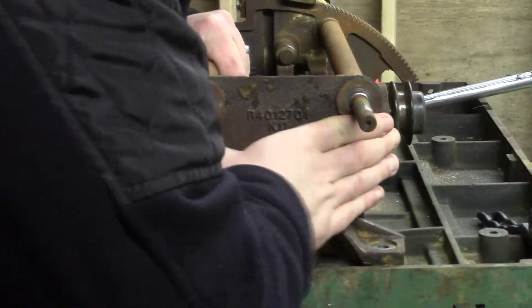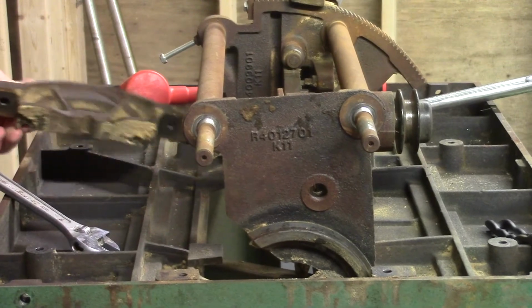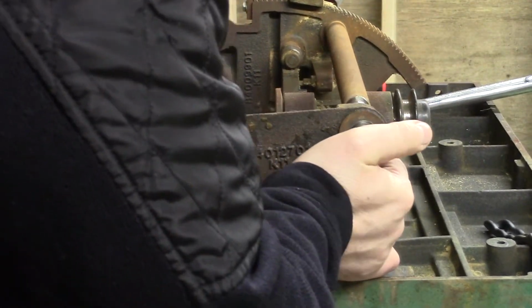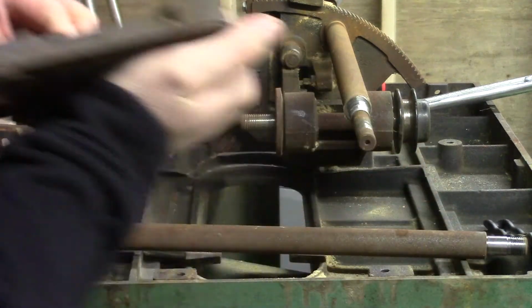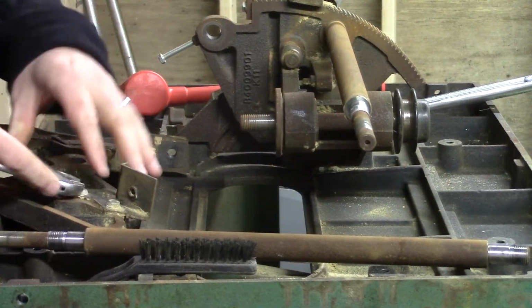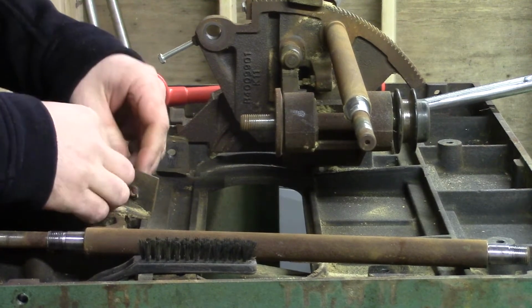Like I said, a lot of these joints probably haven't been disassembled in about 40 years. Like I said before, I hadn't realized at this point that trunnion was two pieces just resting against each other, and there was nothing holding them together, so I'm taking off the other end. As far as I can tell, it's just a linkage that joins up the two trunnions. And with that removed, you can see the arbor, bearings, and the depth adjustment. Just off screen is the bevel adjustment.